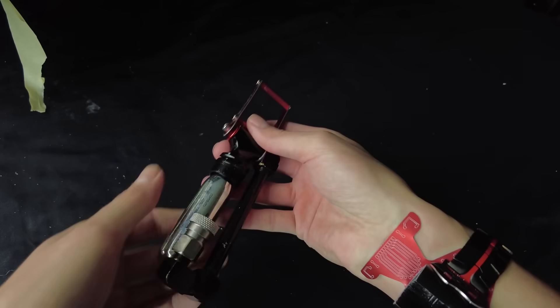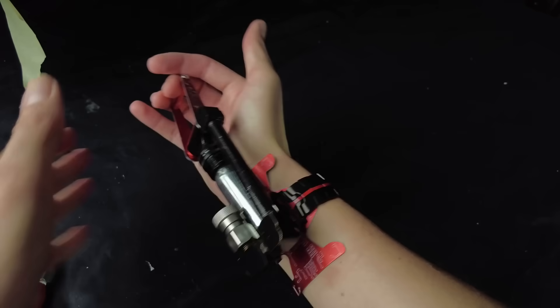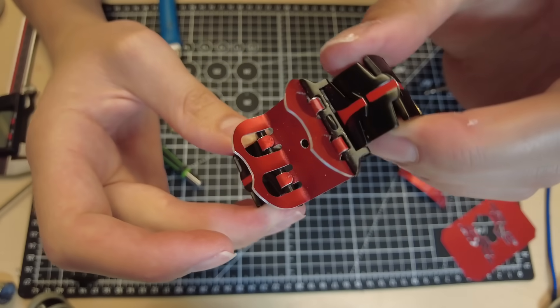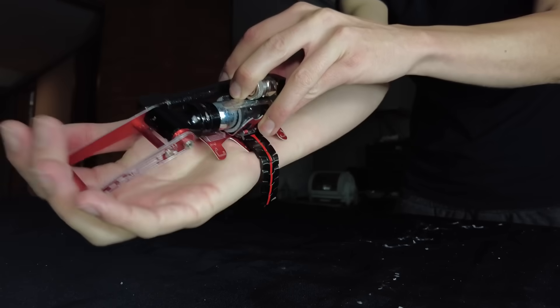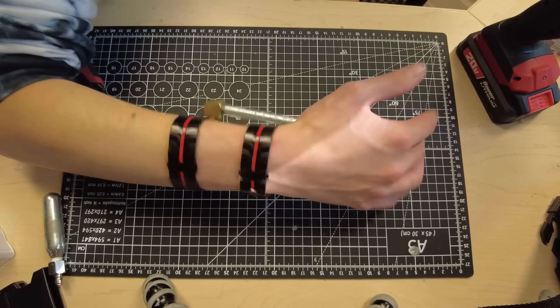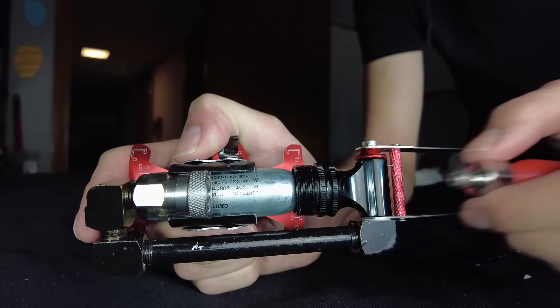The web shooter is comprised of two quickly separated pieces: the shooter itself, and the wrist mount. The CO2 cartridge in the web shooter snaps securely to the wrist mount via a piece of modified PVC pipe. The pipe is mounted to an anodized aluminum wrist plate. In between the wrist plate and the pipe is the watch strap bracket, cut from aluminum, then bent to secure the strap and embellish the pipe. I ultimately chose the watch strap because it was a simple, sturdy, and attractive mechanism that was already designed to easily attach to my wrist with just one hand. The single strap fit perfectly and moved more organically with my body. Because it contains no electronics, its simple valve system ensures greater reliability, and the quick connect system allows for the rapid swapping of a variety of web cartridges, even the ones I haven't invented yet.